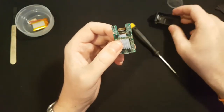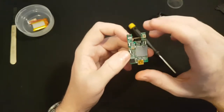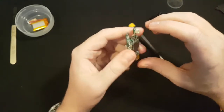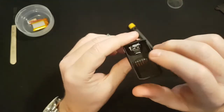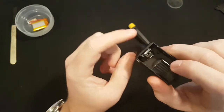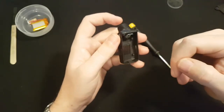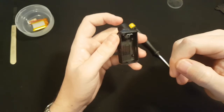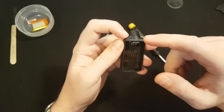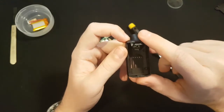There are a couple of these cameras that have been built. I obviously destroyed my Mobius case to get mine out. Another guy that built his managed to pull his board out without pulling the case apart, so it just depends on how you feel about doing that. Once you've got the board out, then you can pull the sensor unit out. Getting the sensor out of it is really pretty easy — I believe you can slide it straight out without even having to take the lens off. Because of the way I disassembled mine, I think I actually took the lens out and then took the sensor unit out before I pulled the board out, and that definitely wasn't the best way to do it as it means you have to go back and refocus the lens.